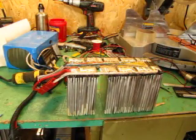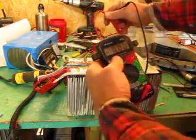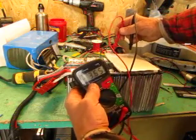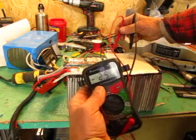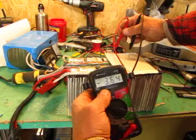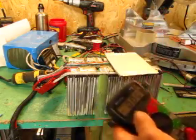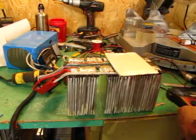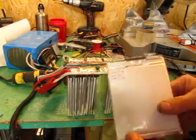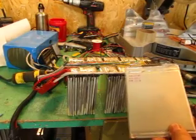These brand new cells are probably already charged up — they're sitting at about 3.65, actually 3.66. So they're fully charged. I have to discharge these down to about 3.2 volts before I put them in, to get a rough balance on this pack. In my next video, I'll have it all together and we'll test it out.